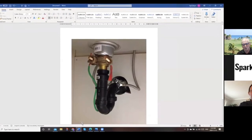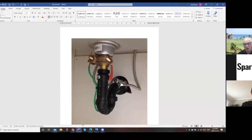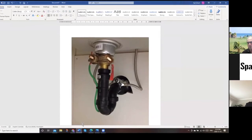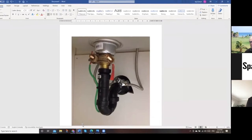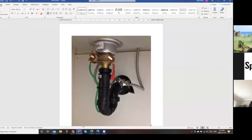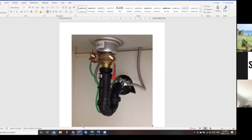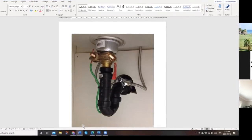Yep. All right. This was sent to me by a contractor. He's doing an installation at a doctor's office. This is in one of the exam rooms, and it's deemed by the code to be a basic care area. And so his question was, did he really need to bond this sink, Don? I think he's made a pretty good point about it. He's got plastic plumbing, and I believe that it's plastic PEX water lines. So the metal of the sink is completely isolated, and I don't see how the code would make you bond it. Don, what do you think?